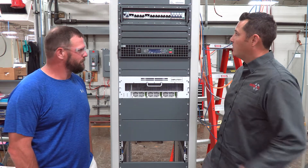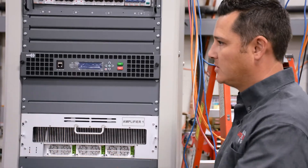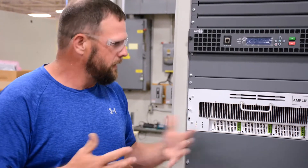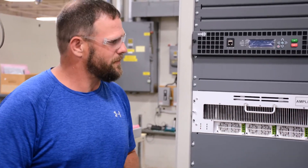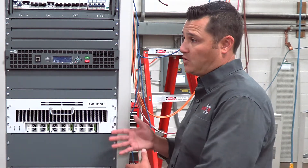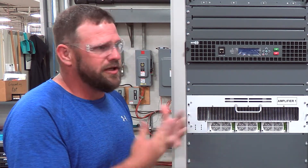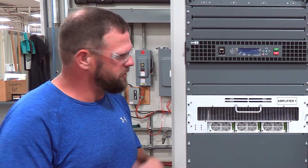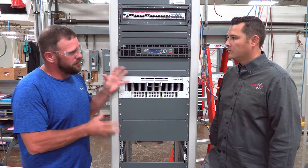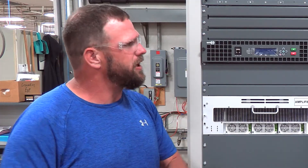Channel 4, okay. And then we've got some — you're testing all the breakers, the exciter, making sure the power supplies are... Everything that we will send along with it is fully tested, vetted out, and proven to be up to our specifications. So what kind of testing specifically do you do for each station and transmitter? For each station, we put it on the channel that it's been required, the TPO, the power level that the station needs when they receive it.